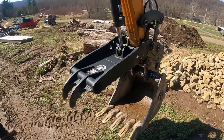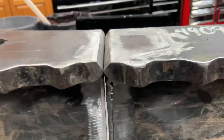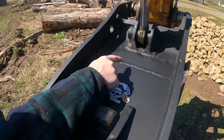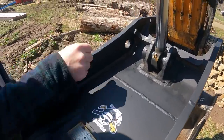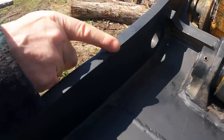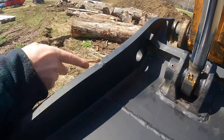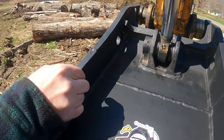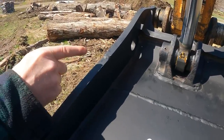So, Doug, probably some people who aren't familiar with metalworking are going to ask, why did you have to chamfer all of the edges down around so much? One thing is because the metal here is 3/4 inch thick, and down on this plate was 1/2 inch thick. So when you go to weld it, I relieved it, basically you take a 45 degree angle on each side of the cut, and you do it on both sides or wherever you're going to be welding. And what that allows, when that metal is that thick, is to get a good strong weld down deep into that thickness of steel.